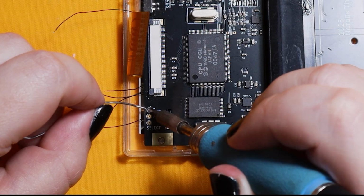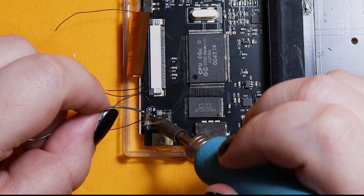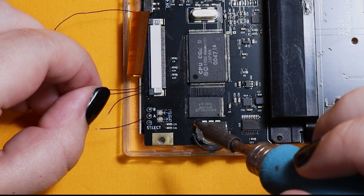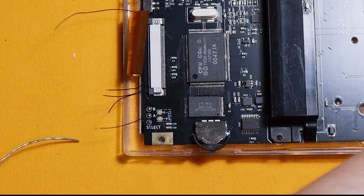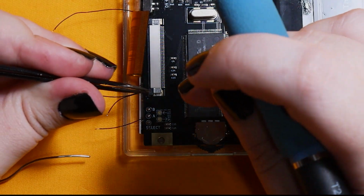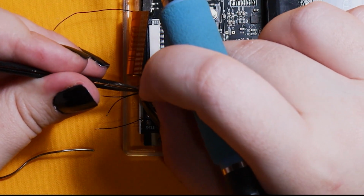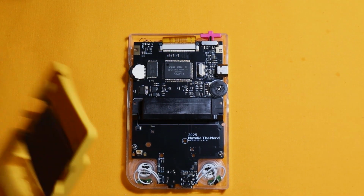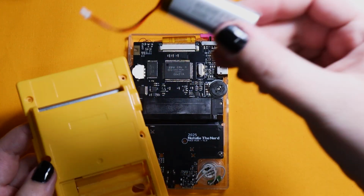Now you can solder whatever you want to the up and the down of the wheel that replaces the contrast wheel, and a lot of people like to solder the touch pads from the screen kit, so you can change the brightness using the thumb wheel. I'll have all this information linked in the description on the tutorial page.